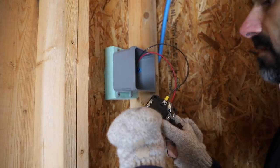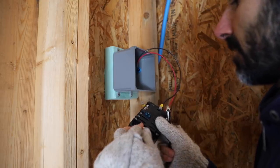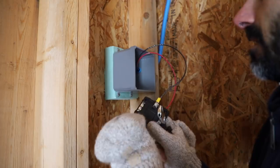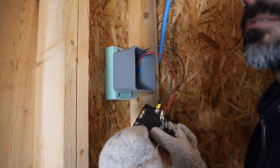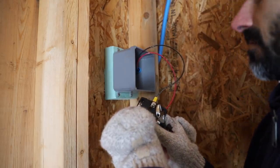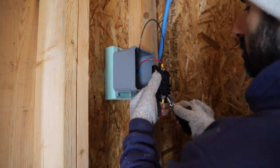positive, I mean. Some of these components, so I was gonna run all my DC from that box, but I don't know if I can get smaller than 15 amp breakers, and some of these components need to be protected by like 3 and 5 amp fuses, so I really can't use that DC box for everything. And I like the Blue Sea stuff. It's really high quality. It is more expensive, but I like it.